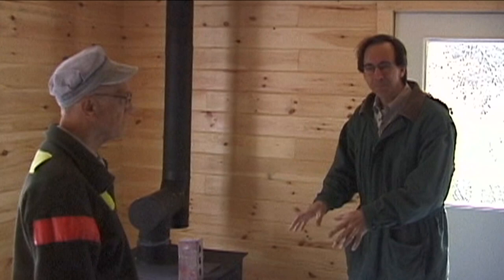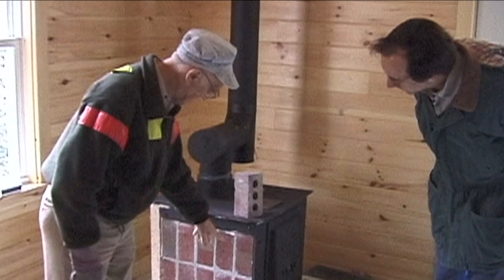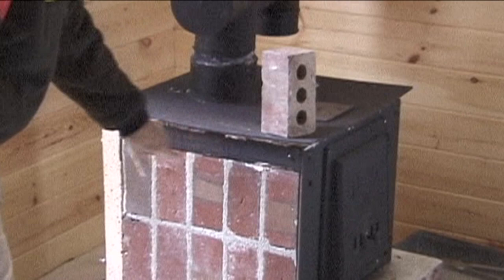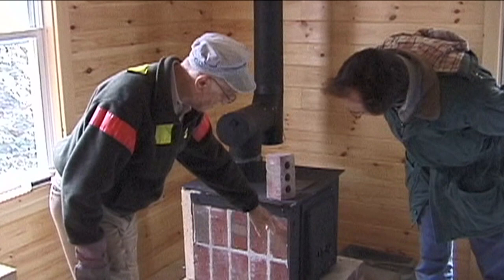And over here, we have a new kind of wood stove. Yes, indeed. I've got some bricks, appropriately, left over from the Patch House, which I purchased from the university. And it has holes in it, and what I've done is I laid the bricks up this way, and I have bolts that go all the way through the holes in the bricks, and they come out the back, and in the back there are my springs. So the whole assembly is pinched with spring-loaded rods, which means that the big gasket in here stays pinched as the stuff expands and contracts. It doesn't open up big cracks.